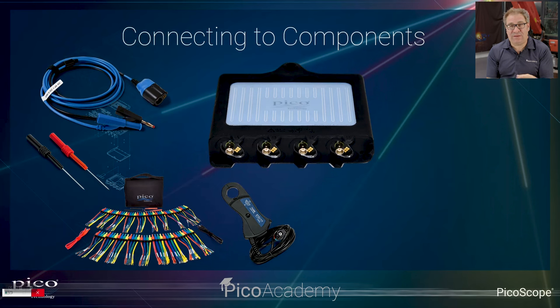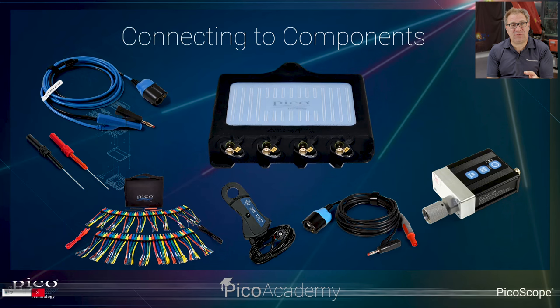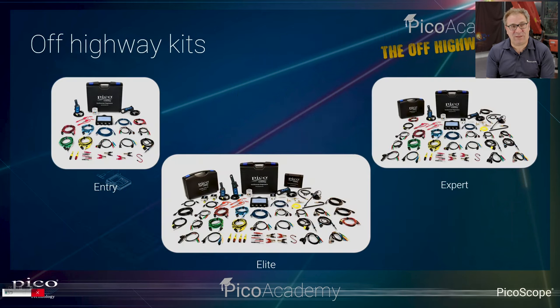but no battery needed, so you're taking the power through from the scope. Then we've got resistance leads, and then pressure. So that's a WPS 600 pressure transducer designed for hydraulics. And then right the way through to the flow meter, which we're going to see later on. So that's the way that we can look at hydraulic flow.